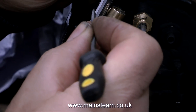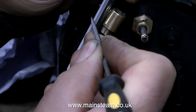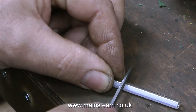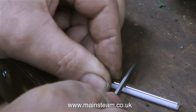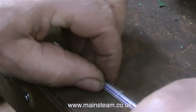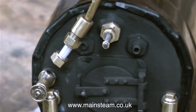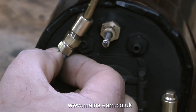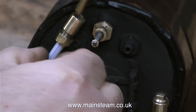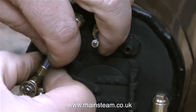By holding this glass against the fittings I can estimate how long the glass needs to be. If it's too long it will cover the hole from the boiler and won't work at all. In this clip I'm using a needle file just to make a small scratch on the glass, then I put the piece of glass on the bench and using the edge of the same needle file I make a deep indentation over half of the diameter of the glass, and then between my fingers I just snap it in half. I don't normally use this kind of glass tube — this is more like thermometer tubing — but it makes it easier to read the water level. It didn't break quite so cleanly as the normal glass that I use, so I cleaned up both ends on the belt sander, which removed the sharp edges and made it much easier to handle.